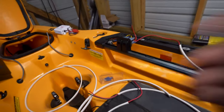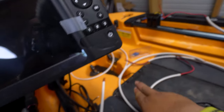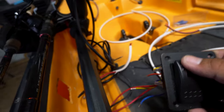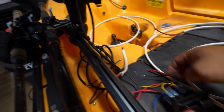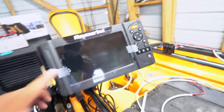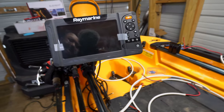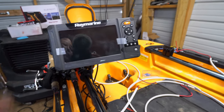Back up a second — from there we have another wire that continues to this breaker, which is on the other side. These breakers are installed in these holes; I've already drilled the two holes and pulled the breakers out so we can see them. The way I've organized it, the front breaker will control the front accessory. This front breaker goes to this cable, which will be attached to this fish finder. This is a Raymarine Element unit — only a 6-inch screen, but it's a good entry level for just about everybody, even tournament anglers.